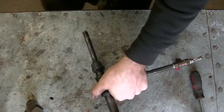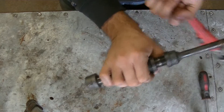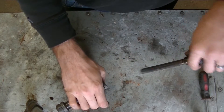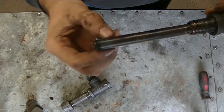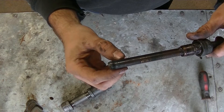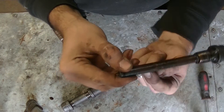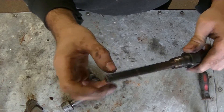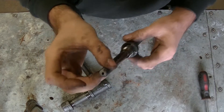What I'm actually going to do is cut this back here and then make something on the lathe that will butt onto this — it'll have internal threads. So I'll cut this off, make something on the lathe with internal threads, put that on, and weld it on. Then I'll have a nice, good piece of turned material with threads on the tip, and from there I will make the tips. That's what this video is going to be about.